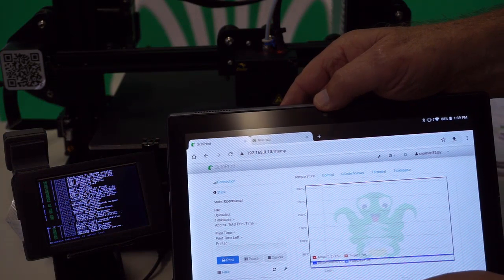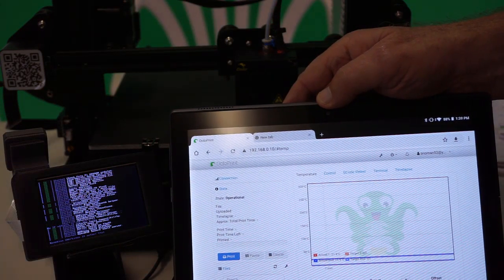It is stable. It will play nice with OctoPrint. It will see your prints to completion without halting partway. The compilation procedure outlined here carries over to pretty much all brands and models of 3D printers — specifically if you have the Ender 3 or Ender 3 Pro with the 4.2.2 32-bit board. I will make the compiled file available on my Google Drive with a download link. If you can't trust me, who can you trust?